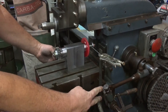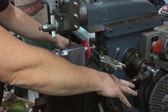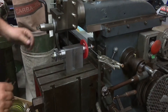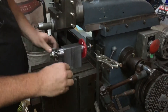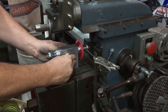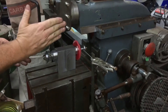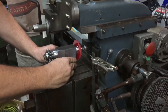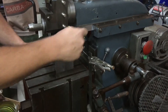We're looking to fix onto the vertical knee section of the shaper with a couple of uprights. From that we're going to suspend a piece of wire in the back which I'll show you a bit later on. The wire is wrapped around the pitch circle disc. So as the bed moves across you can see there the cutter will be coming straight through the gear, and the gear rotates on that pitch circle diameter as per the disc in the back.